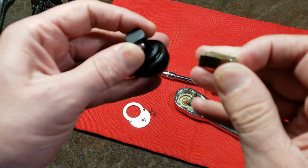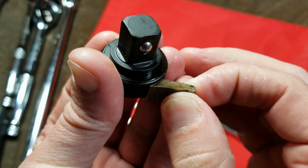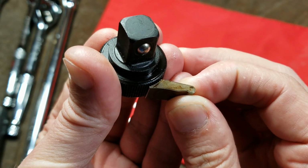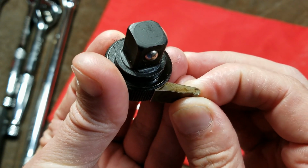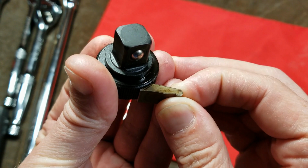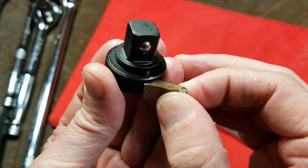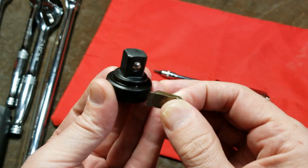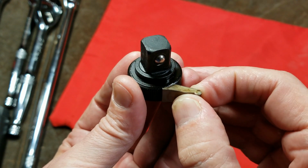There's not enough steel. If this were a very coarse ratchet, then there might be enough steel in there, but with this type of design, you just have that little contact of whatever that is there, 6 little teeth, very fine, very shallow. There's no way that that's going to hold the hundreds of foot-pounds of torque that it takes to shear or break off a half-inch drive anvil. And many times you use a half-inch drive ratchet as a breaker bar. That's what a lot of people have.